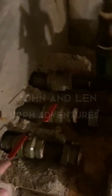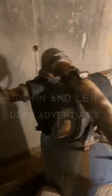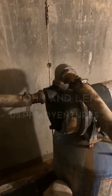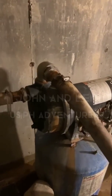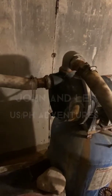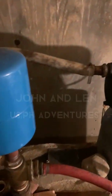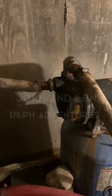Now I want to explain a little more what I have going on here. As you can see there are three valves — one, two, and three — and that one over there is open, putting water up through this line into this electric pump. This electric pump is set so that if the 1,600-gallon tank runs empty it kicks on and stays on until the tank is full, then kicks back off. Hopefully the ram pump keeps the thing full, which it does most of the time, but if I'm watering the yard and garden when it's really hot and using a lot of water, the ram pump can't keep up — but that one-horse pump will keep up with my water needs.